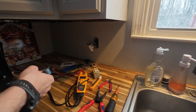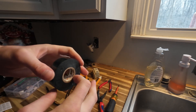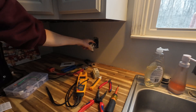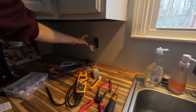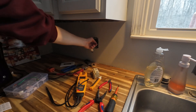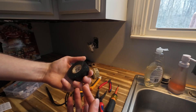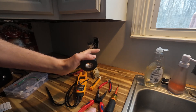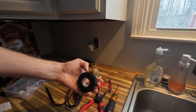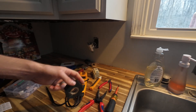I like to put on some Super 88 tape — use high quality electrical tape if you're going to do it at all. This is a metal box and you can see how tight a fit it was to pull it out, so putting the new one in is equally tight. You don't want any of the conductors touching the metal side. Not a requirement, personal preference. I know a lot of you hate electrical tape, but try some good quality and it might change your view.